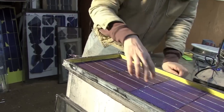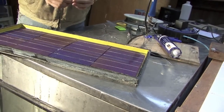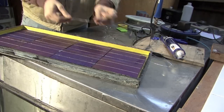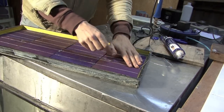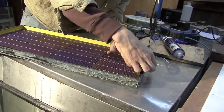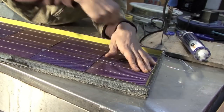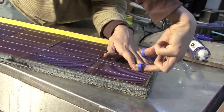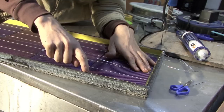Up this end of the panel, we're going to do much the same thing - solder three pieces of tabbing wire onto the top here. But this time, instead of running off like that as with the terminal, we just want them to come up to about that high. So I'm going to cut them here so they're just sticking up like that, and we're going to solder three of those on.